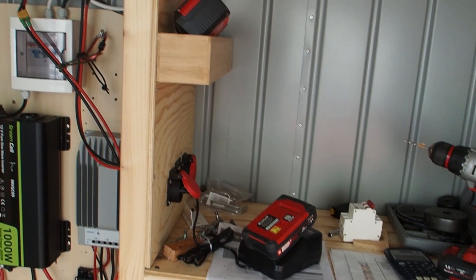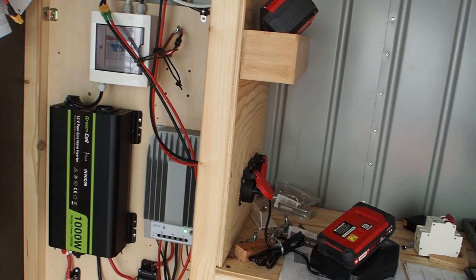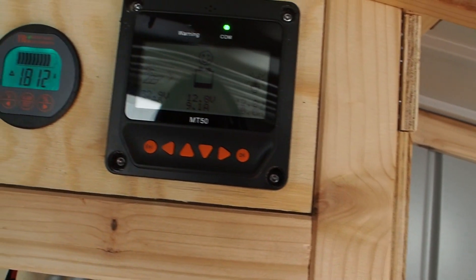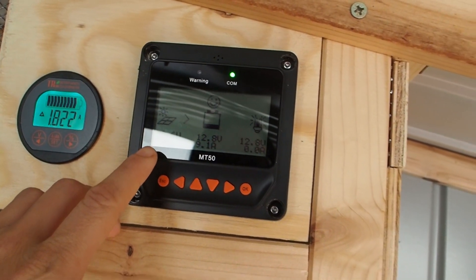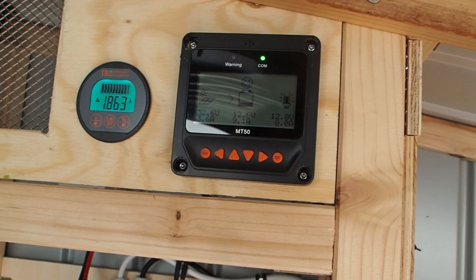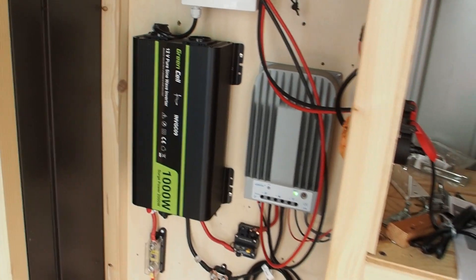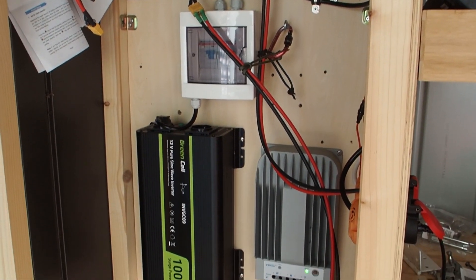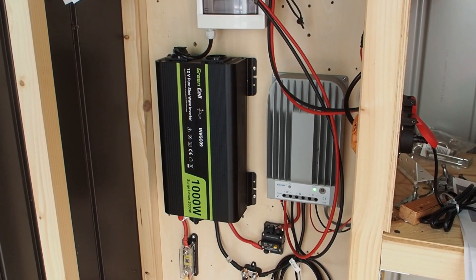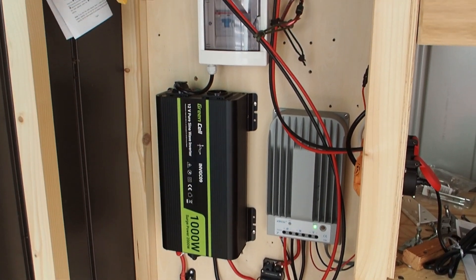Today it's actually cloudy and the solar system still works fine. It's no problem to recharge smaller devices like drill batteries. A refrigerator would also be fine — my fridge uses about 86 watts, which is under the available solar power. So that's how you calculate breaker and fuse size for your solar system — it's not that difficult. Thanks for watching and stay tuned!